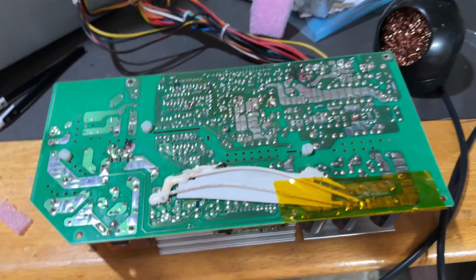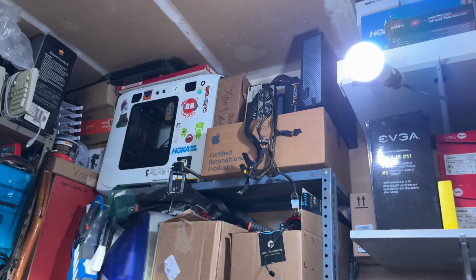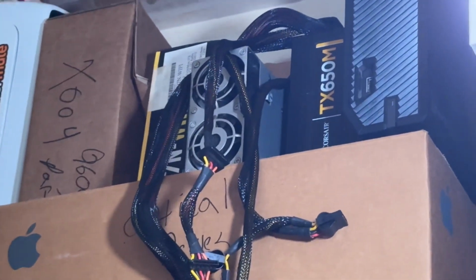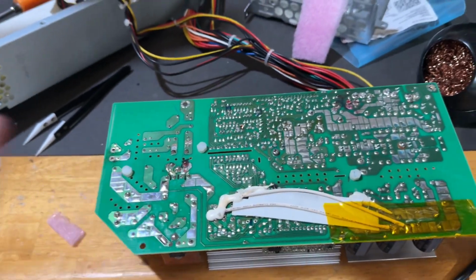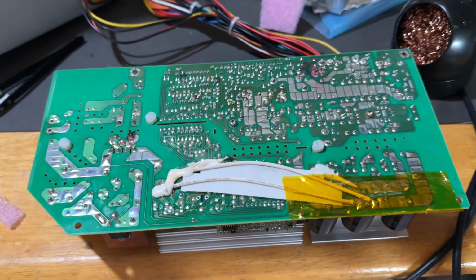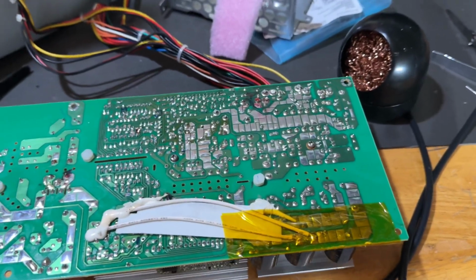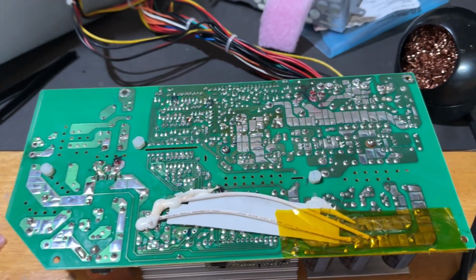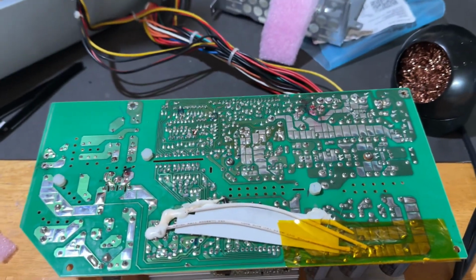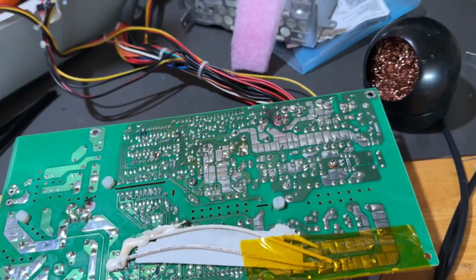And I can move on with other projects. The other project I want to do with regards to this machine is, I believe, up there somewhere, yeah, you can kind of see it right there: I have another MDD power supply. That one is the Samsung variant, and it has not had its caps mapped out yet. Nobody knows what they are. I'm sure there's a resource somewhere on the internet that has them, but for caps.wiki, it's simply not there. So I do plan on taking that one apart and getting all the cap values out of it and documenting them somewhere. I'm not going to find the replacement parts because that's not my forte. Other people can take the original measurements and probably find ones that work. So yeah, that's why I'm being held up.